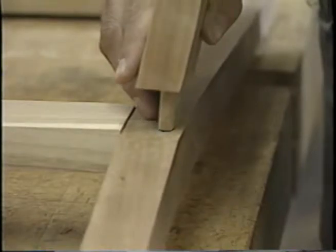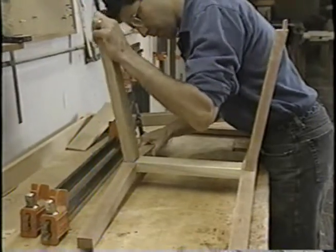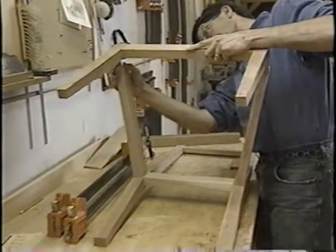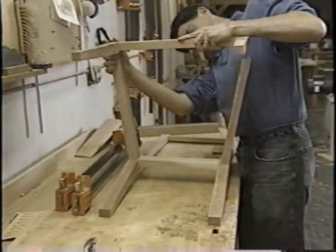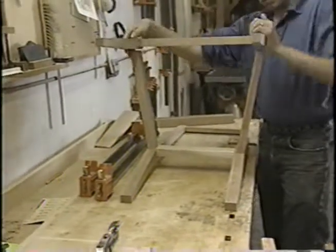All right, let's see what this chair looks like as a whole. I'll clamp up the frame tightly as soon as I've got the chair dry fit to be sure I've got everything just right. I pre-assemble the front and rear frames, as I will when I glue up, to keep the clamping manageable. With good, tight joints, there will always be some fussing to get everything together.